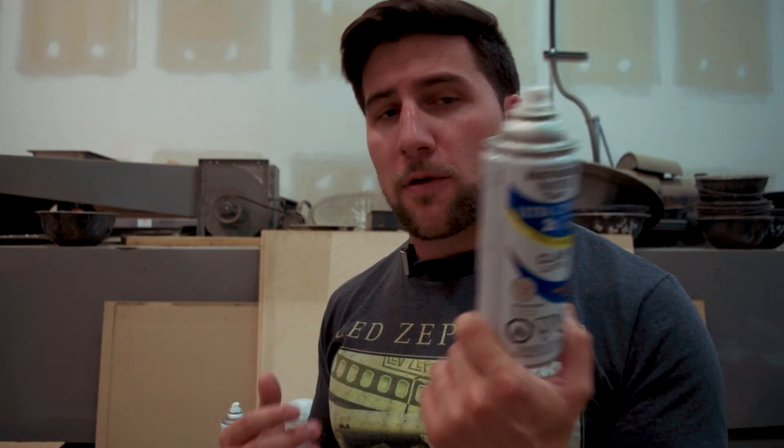I'm gonna build up three coats of gloss at a time, probably do this twice, but I'll see how it looks after once and sand back. First I'll take the 400 grit paper, scuff this down, then put three coats on about ten minutes apart — your average flash time. The final thing will be one coat of semi-gloss clear on the front. I'm also going to put my initials on the headstock using a Sharpie paint pen from Home Depot, and put that under a couple layers of clear as well.